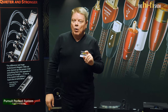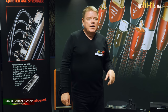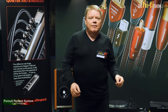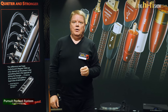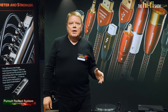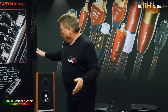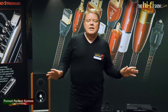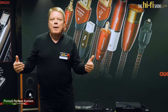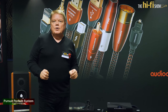And why? Well, one of the reasons is that what comes out of an amplifier is never 8 ohms. Even if you have a traditional valve amplifier that is silkscreened 8 ohms on it, what really comes out of it is a fraction of an ohm. It has to be. If you had something that was truly 8 ohms out and you essentially loaded into 8 ohms, you would lose half your amplifier power. That would never work, and you'd have the muddiest bass ever because you'd have zero damping factor. No, that's not really going to work.